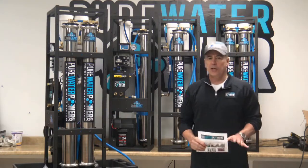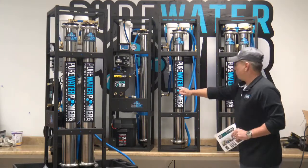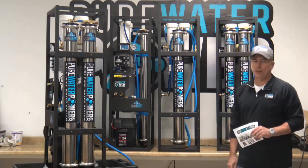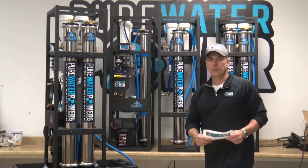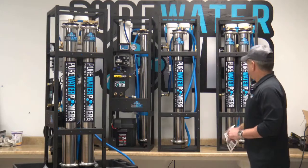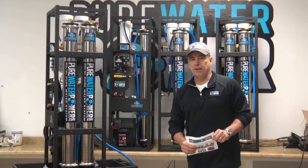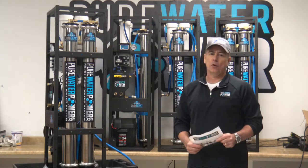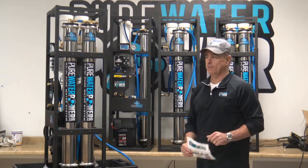And just to give you a little bit of education on what these systems will produce and what it means for you, the single RO tap pressure version will produce 0.75 gallons per minute, assuming you're hooked up to a 50 psi water source. And what that means is you'll be able to operate a single pole with 4 jets up to 50 feet. The dual RO version will produce twice that. So that one will produce 1.5 gallons per minute. And what that means for you is you will be able to operate two water-fed poles with 4 jets up to and beyond 50 feet.